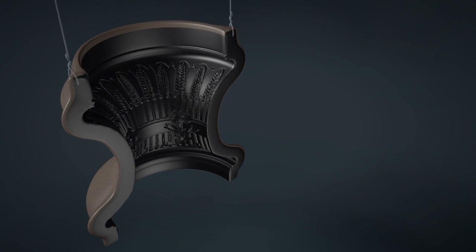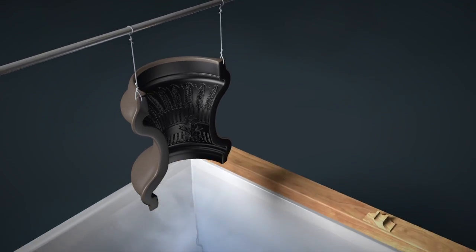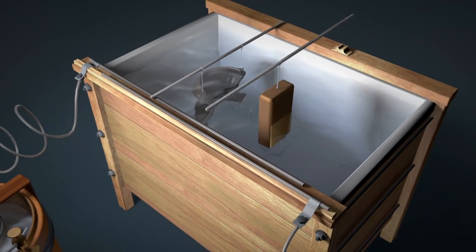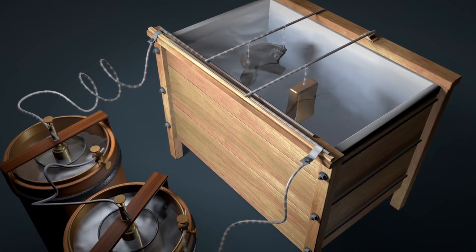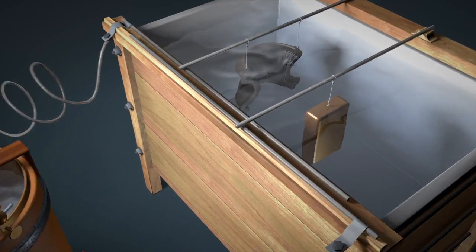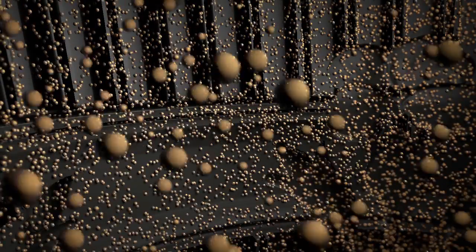Wires are attached to the inner surface. The mold is suspended in a copper sulfate bath with a piece of copper, and an electrical charge is applied. The negatively charged graphite attracts the positively charged copper ions, eventually building up to form a thick copper wall.